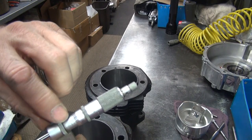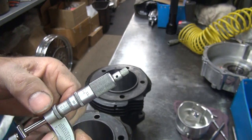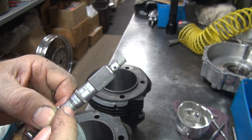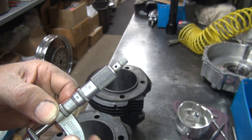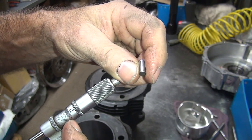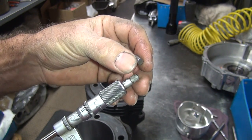A lot of mics will have a vernier scale on the side, and that breaks your thousandths up into tenths, giving you tenths of thousandths. Right now you can see we're on zero. The first big mark is 100 thousandths, the big two is 200 thousandths, and the little marks in between are 25 thousandths each. This wheel has 25 thousandths per turn. Every time you go up 25, it goes up one mark; go down 25, it goes down one mark.